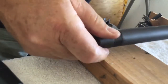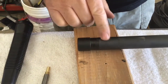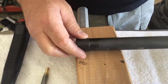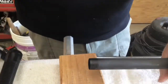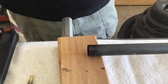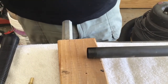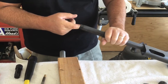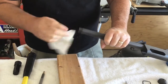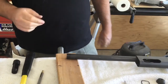Now let's work the other side a little bit. I've worked on that metal with a soft punch and I think it's pretty flat. I can still feel a slight indent there, but one thing I noticed is our tool is now freeing up and I'm able to pull it out of the tube without all of the rigmarole you'll often read about — using vice grips and tying it to elephants and everything else. I do feel just a slight bit of dimpling inside the tube still, and I think that'll be easily cleaned up by using a soft cartridge roll.